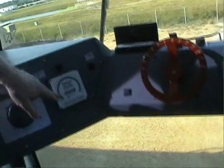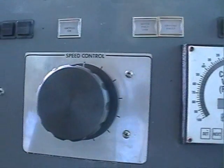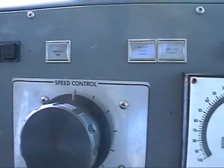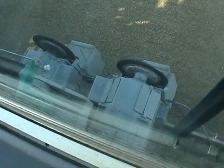This right here is the actual command voltage being applied in the forward or reverse depending on the direction of travel. This is your gas pedal. And this tells them that the exciter's on — if the exciter's on and they start applying current, they will get motion. You can see with the disc — stand right here and look down and you can see what the engineers see when they start the DC propel. They look at those discs and watch them start turning. The DC propel generators also act as a brake coming down the hill if there's a load on board.